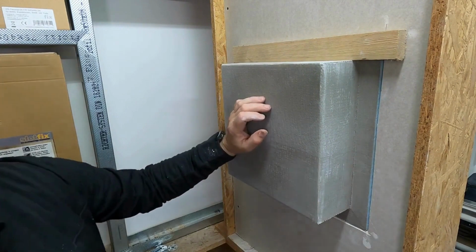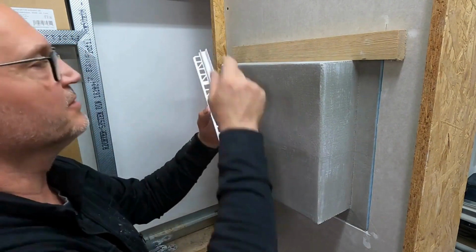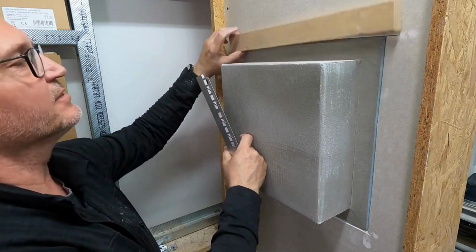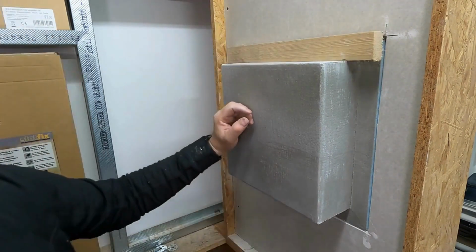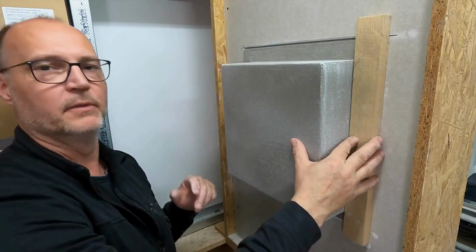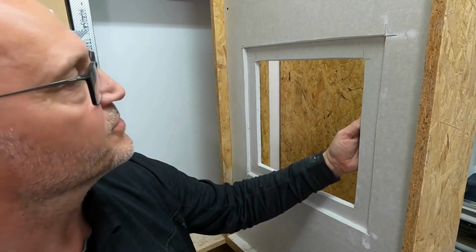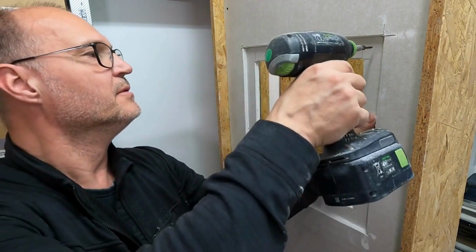Now, my little tip. What if I want to work with this separate lighting here? If it's mounted from above and might need wiring or anything else, I wouldn't fix the batten at the top here, but rather on the side. This way I keep the upper area free for potential future lighting. I simply attach the roof batten at the back. I could also use a metal profile. That wouldn't be a problem either.